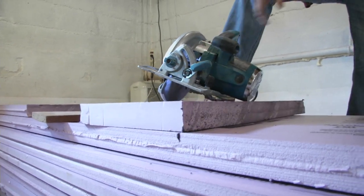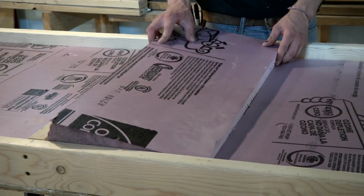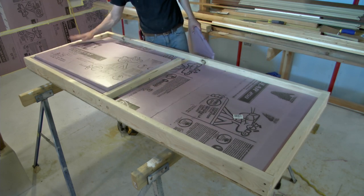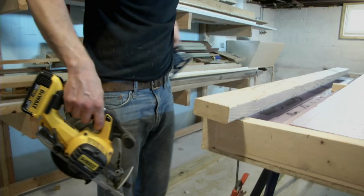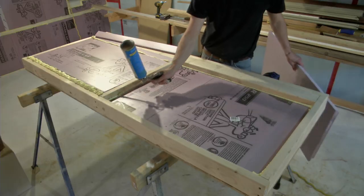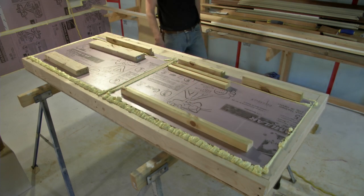To build an airtight door, I start with a frame of 2x4s attached to a piece of zip system exterior sheathing, which has an air barrier built right in. I fit pieces of rigid foam to the interior side of the door frame in 2 layers with staggered seams. The first layer is 2 inches thick, the second is 1.5 inches thick, and butts up to a 2x installed on the flat, which provides backing for the door hinges. Once the pieces are cut and fitting, I set and seal them permanently with canned spray foam, sealing everything in place, and weight the rigid foam down with scraps of wood while everything sets up.